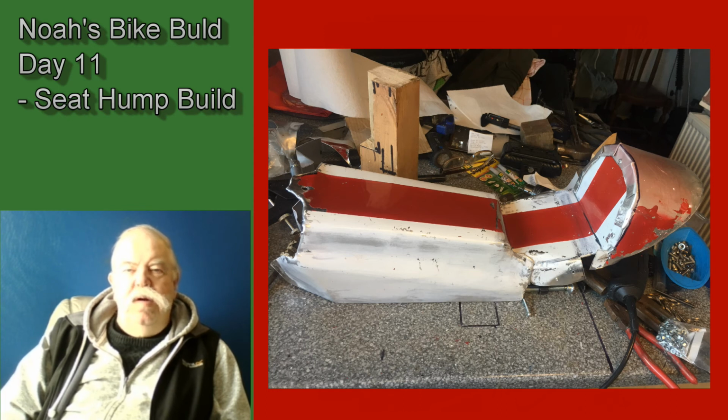Super. The key to this structural success was carefully shaping it around the curvature and drilling it while maintaining the tightness between the peak and the upright, and a simple pop rivet attachment at either side towards the base of the upright. So I had a 3-point mount which will be improved and increased when more supplies arrived, and I had a peak attached.